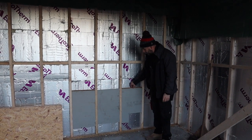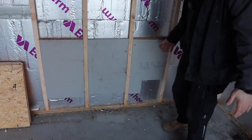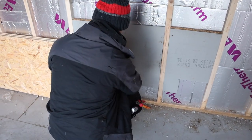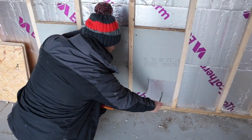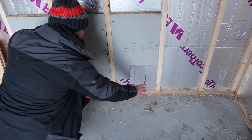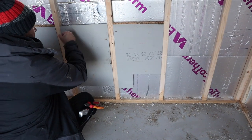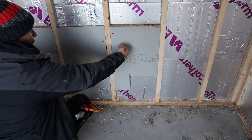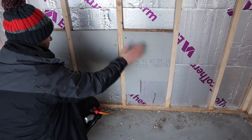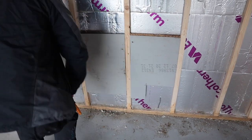We've put these patresses in. Basically, a patress is a piece of wood behind the plasterboard which will allow fixings. So there's a heater going there. We know from experience that that's enough patresses that will carry the heater. That cut out there is for the fuse socket, because we don't want any wood behind when we're putting our plasterboard back box in, and we are using plasterboard back boxes. So like I say, it's just a bit of flooring. It's screwed and spiked through the sides there, so it's solid, it's not going nowhere.